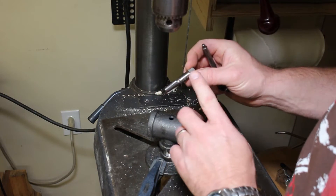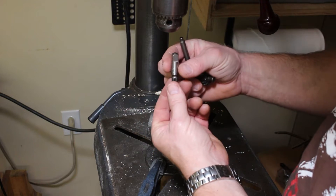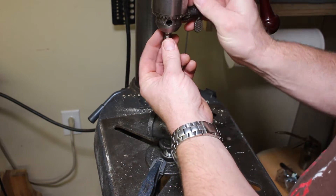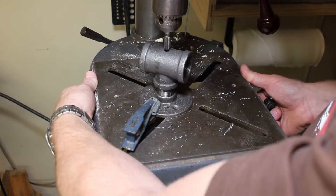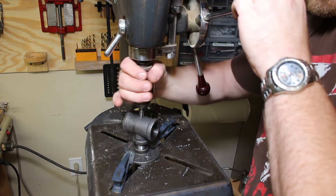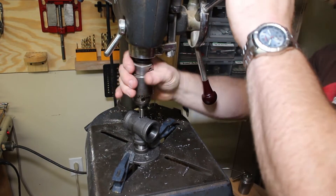Now's the most critical part — I've got to make sure that I tap these threads completely straight. I'm going to put it in the chuck, retracting the chuck enough to grab around the cylinder's outside diameter, since this is a three-jaw chuck and the fitting has four sides. I'll put it all the way in, grab it, and quick-turn it on to make sure it's centered. Then I'll lower it and turn it by hand to get it started, applying downward pressure, turning it, and backing it out. You can use some cutting fluid if you want — never a bad idea.